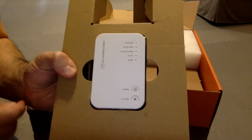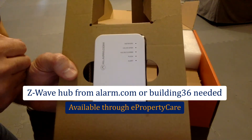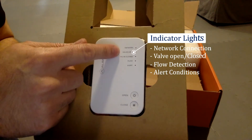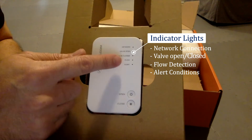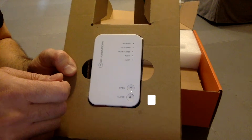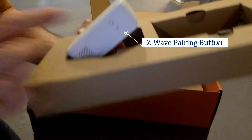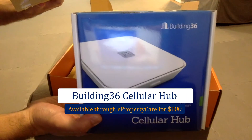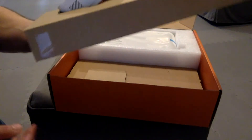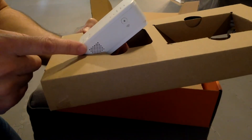This is the electronics, and it supports Z-Wave only, so it requires a Z-Wave network hub through alarm.com or Building 36 to operate. It has LEDs indicating whether the valves are open or shut, flow detection, and alert conditions. There are also buttons to open or close the valve manually. On the side is the Z-Wave pairing function, so once you have a gateway such as the Building 36 Z-Wave cellular hub, that's how you would pair it to the overall system.